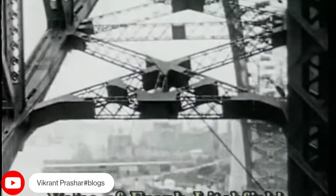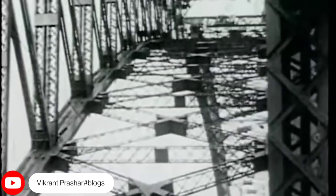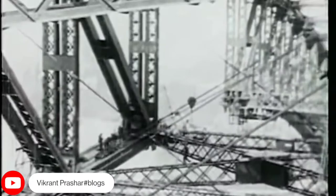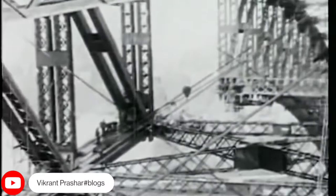Up through the float of the arch with the sway bracing, those 3-inch cables were used to crisscross the tension with hydraulic jacks to give rigidity to the structure as it was built out. Well, just when we reached the construction and got out to the 14th panel with the crane on the 13th panel, the deflection of the half cantilever happened in that order, about 3'6".